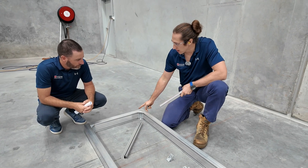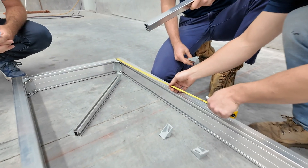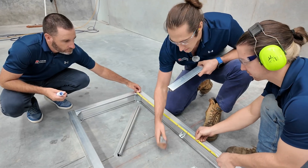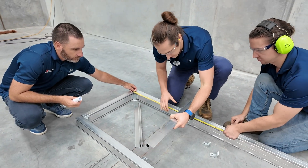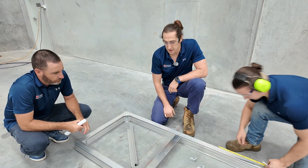These need to be a maximum of 700 millimetres from either end. Same principle as before — the brackets key into the aluminium extrusion. It's a maximum of 700 mil so it doesn't need to be exact. Key into the extrusion, install the mesh support bar, and it's fixed with a T-bolt underneath each side.